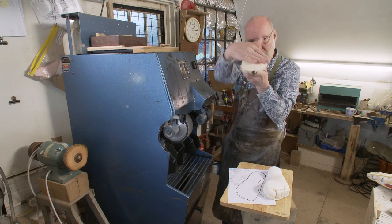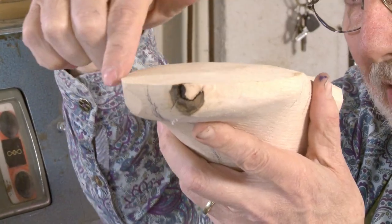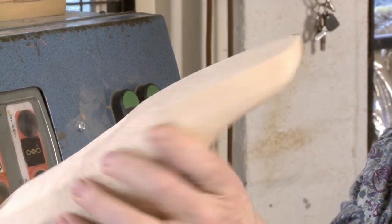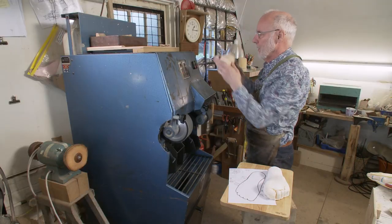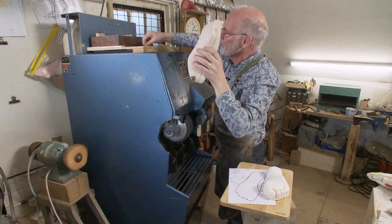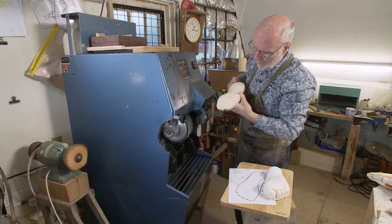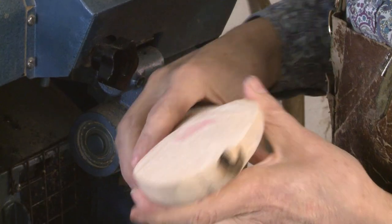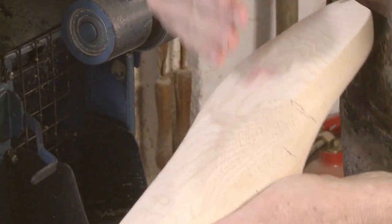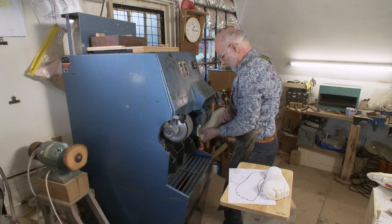So the crown is this curve here, and the range is this smooth shape here. Okay, so that needs to look pretty straight. The tread is where it touches the ground, a bit more chalk. You see, there's the tread where I want it, and now I want the break point where it starts the curve and the arch to be shaped.